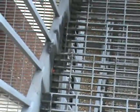They look good, but at the bottom, some of the treads weren't touched because it was a spot repair only. But now we require that all the ones that don't have a bolt be treated. If they're in fairly good condition, not to open up, but you need bolts now to back up the welds and seal. Always seal.